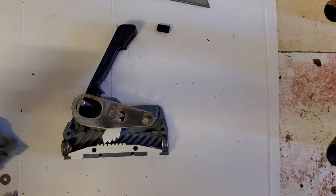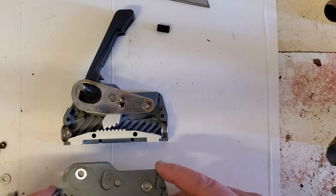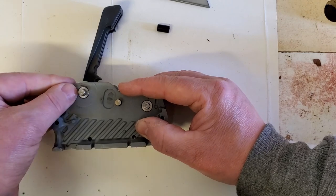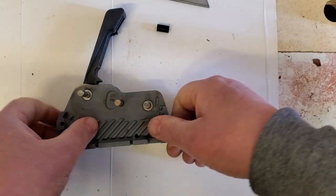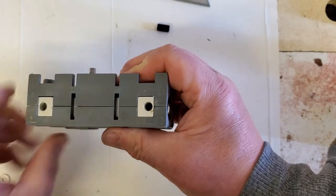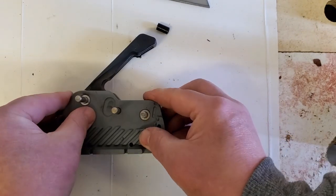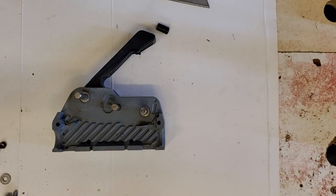Now we've got one side built, bring in the middle piece. It's a case of lining up the bars with the holes and sliding it down nice and securely, giving it some effort to close it up. If it's reasonably close then this join in here should be reasonably small. The final closure will happen when we tighten up all the bars, and that is how you put together one side of the jamming clutch — the second half is pretty much the same.